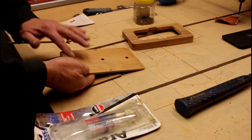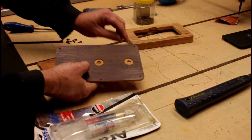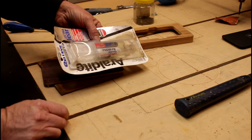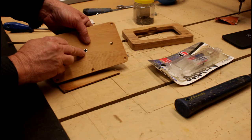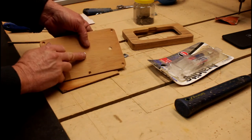These four holes here will be for the screws to hold the back on, and these two here are pockets for T-nuts to go into, which I'm going to use some Araldite glue to hold in place to make sure they don't move. I've modified them so that they do not come past the bottom here, so they're always just below the surface.